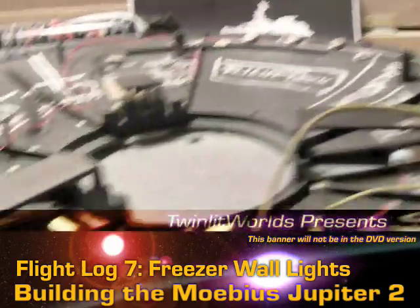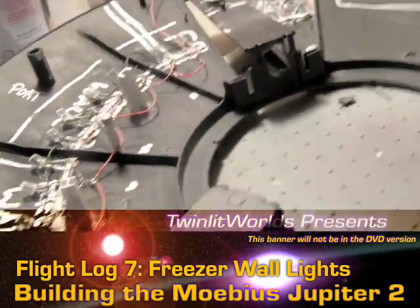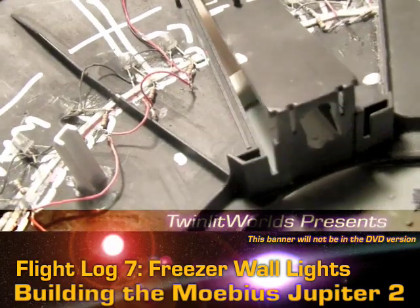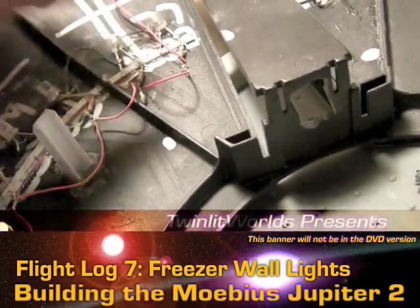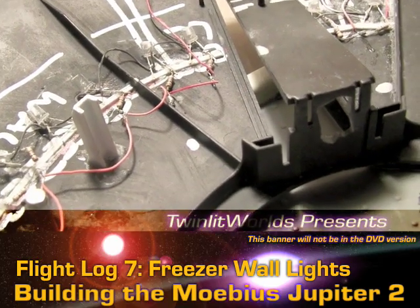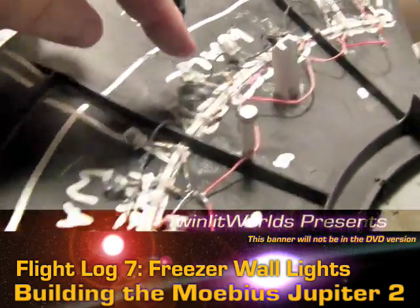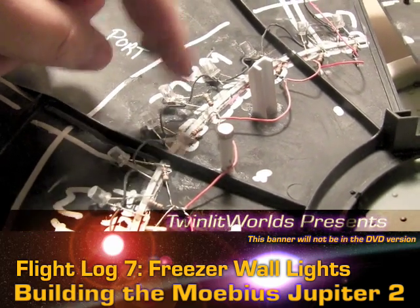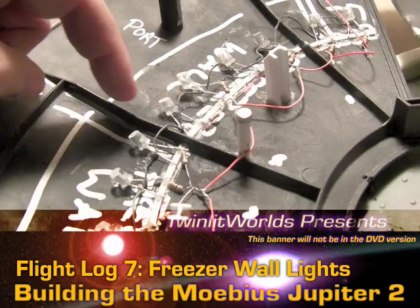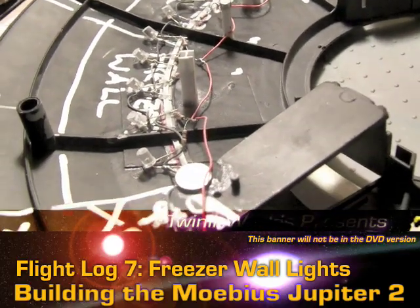One other trick I came up with: I picked one wire here — this became the end of a foot-long wire. I measured out an inch or so and then used my thumbnail to pull a little bit of exposed wire out, strung it into the next one and so on. This black one here is one continuous piece of wire that I simply stripped a little bit mid-length, looped it around the leg of the LED, measured it out, ripped off a little more insulation, wrapped it around, and soldered it up to the end. This entire piece is one wire, rather than doing individual wires to the master.